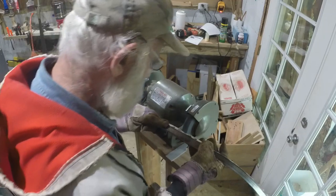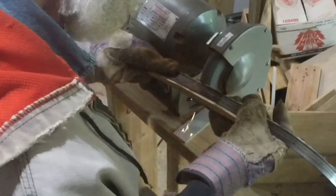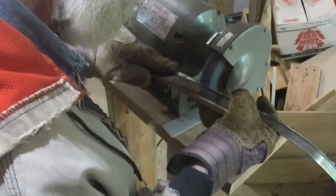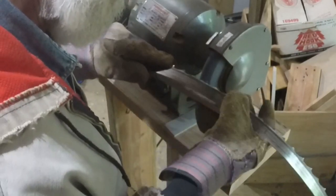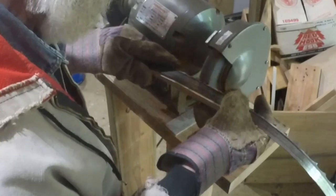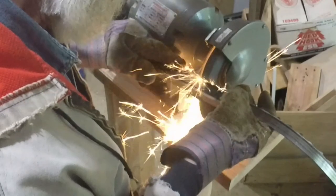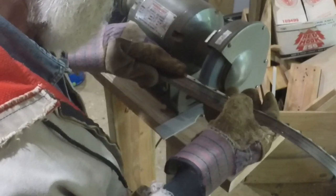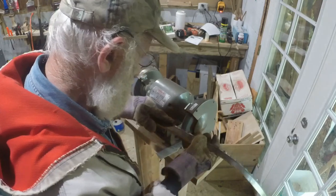That worked much better than the Dremel tool, but it was still inconsistent. If I didn't slide the blade in just right, I'd take off too much tooth or not enough. This method also raked up the back of the next tooth. Woodland Mills sharpeners do not do that. Cook's sharpeners do. So I guess it really doesn't make any difference. The important thing is to get the face of the tooth and the gullet.